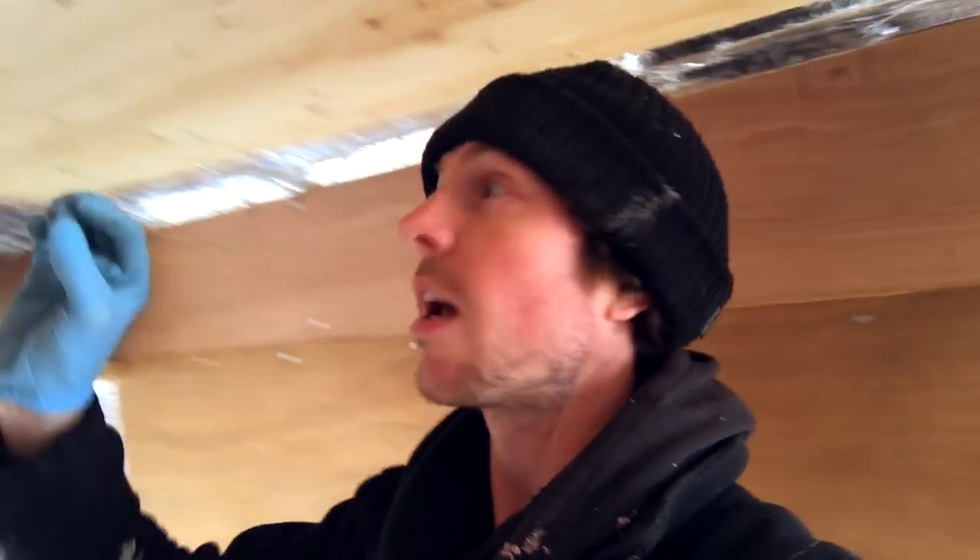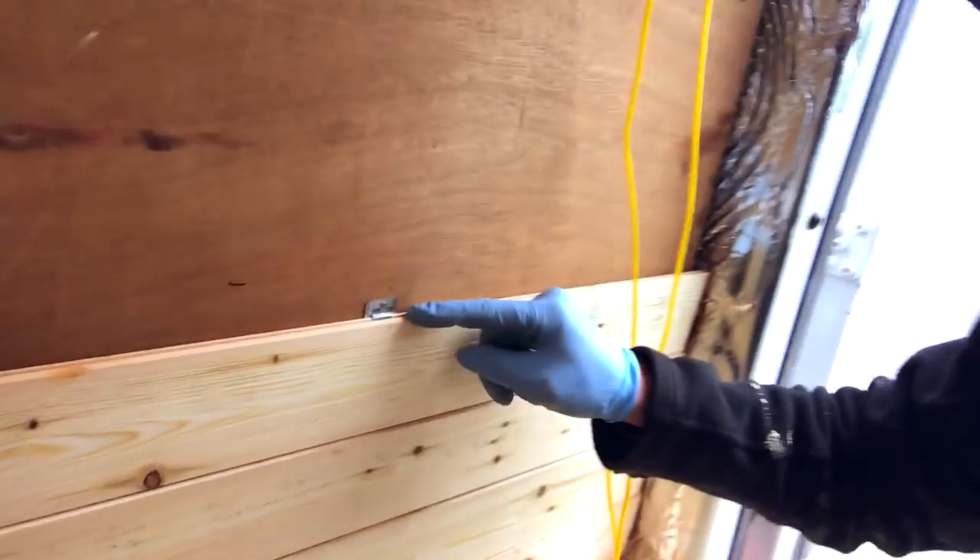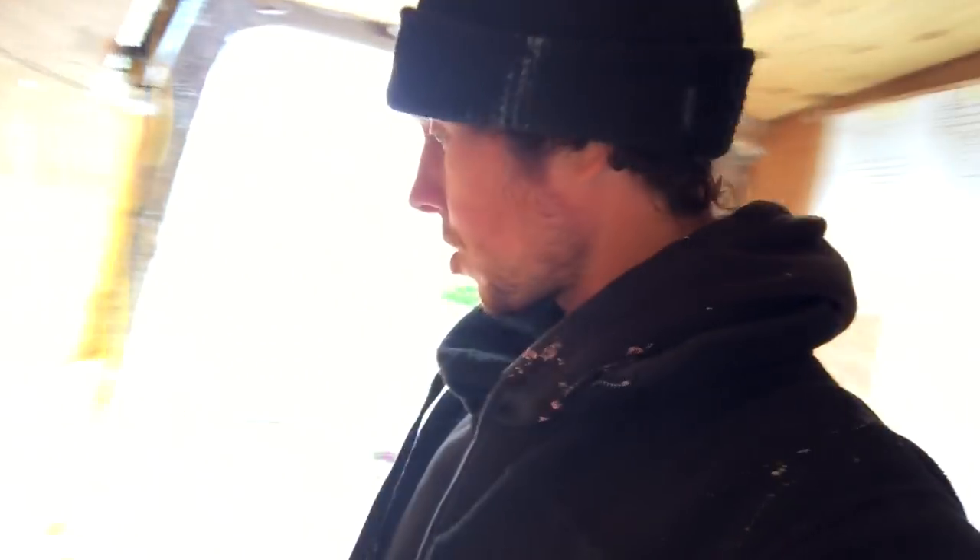I was planning on using cladding clips, so I started putting the cladding in and thought I'd start using the clips at this point. But I'd started with the groove at the back and the tongue this side — you need the groove to be on the direction that you're going. Lessons learned: I've started a new bit, building up with the groove here, and then you can build the cladding clips in. They seem to be doing a really good job holding it on there.